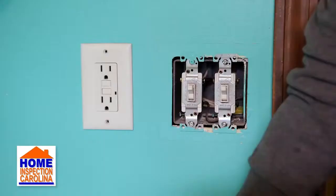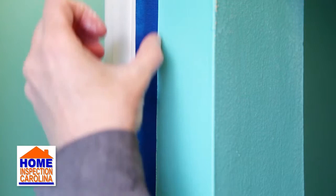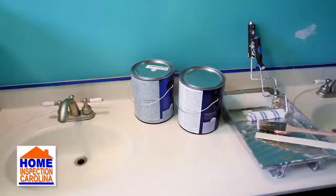Taking pictures and mirrors off the walls, removing outlet covers, and repairing holes in the drywall. Also, remove any dust or cobwebs that may have accumulated in the area. Apply painter's tape as needed to make painting edges easy. Make sure you also lay painter's tarps or old blankets to protect furniture and floorings.